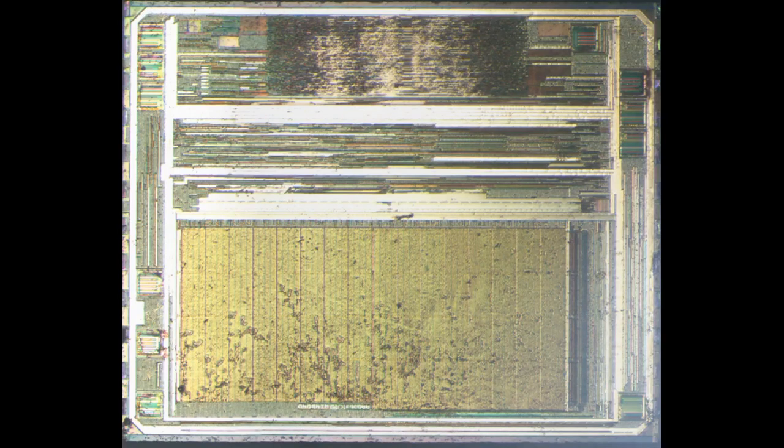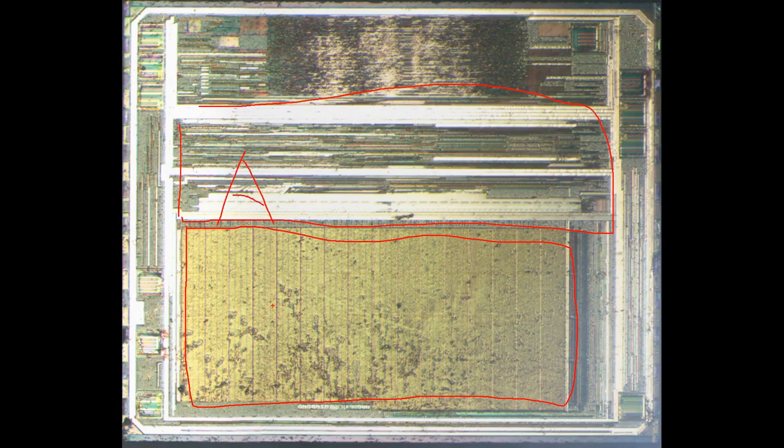The IC we're looking at here is the persistent storage, or NOR flash as it's sometimes called. The actual array which stores the information is here in the middle. There are two regions: one is the analog function. We need to program these NOR flash cells at tens of volts, so you need a bunch of sense amplifiers and analog functions in the middle. And then up here at the top is a digital section, which provides what they call SPI — serial peripheral interface — the connection back to the computer.